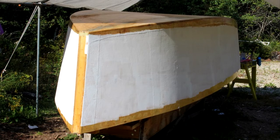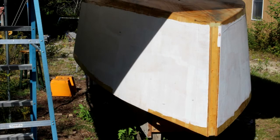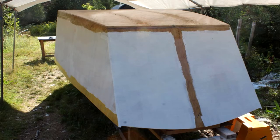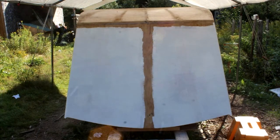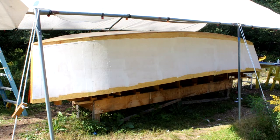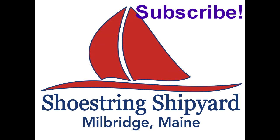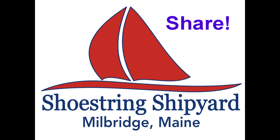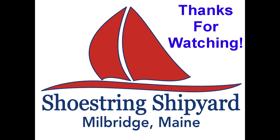Shortly after applying the two barrier coats of epoxy resin, I went ahead and applied primer to the sides of the hull and on the transom, just to protect the epoxy from the UV rays of the sun. Where I didn't cover, the bottom will get bottom paint. I still have to add the outer stern post on the transom — that's why you see a strip not covered right down the middle. And of course I have to add the false stem.